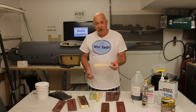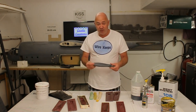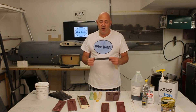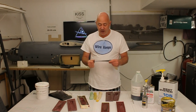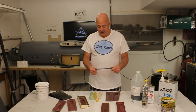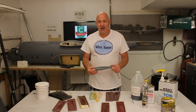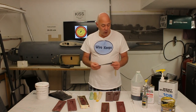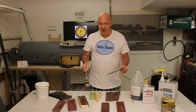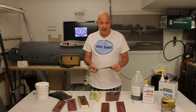I started this whole process by taking a master air screw prop and cutting it in half. I then got it shaped the way I want for the C-130 propeller, then I would prime it and put at least one coat of the color I want, then five coats of clear glossy enamel. The important thing is to wax everything many times.